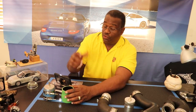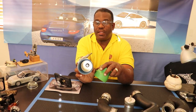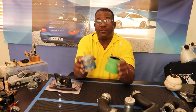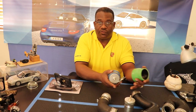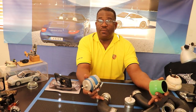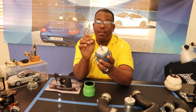These are adapters that go onto the throttle body itself — this mounts directly onto the throttle body and then you can pressurize with your air. The reason I'd have something like this is sometimes the Y pipe has to come off and then you can't connect to it. You certainly can't connect to the turbos directly because it goes through the intercoolers to the Y pipe, so you want to connect directly to the throttle body.